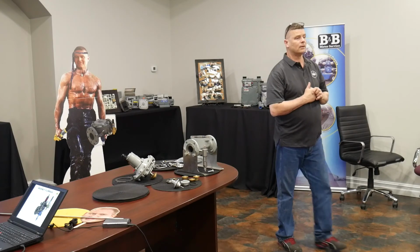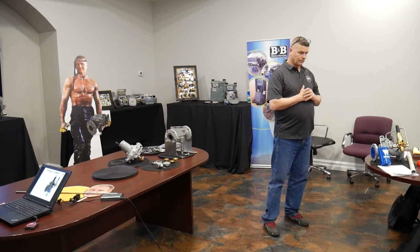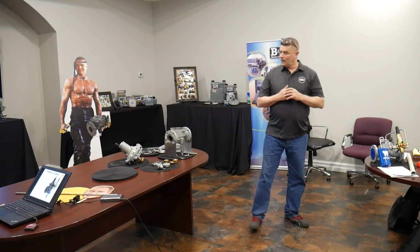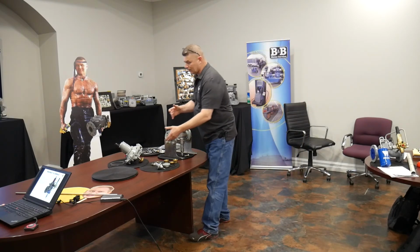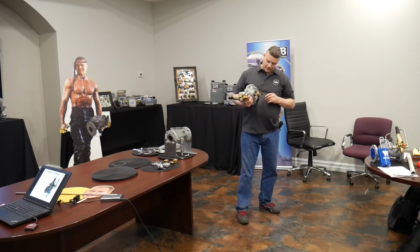Yes. So the lower portion of that Flowmax obviously takes a lot of the dirtier gases coming through, and there is some gas exposed in that top area of that diaphragm, where the rebuild kit would be. How often have you really seen people have to go out there and put in a full rebuild kit and clean that thing out because debris or something's caught in that top?